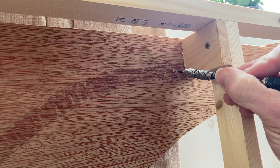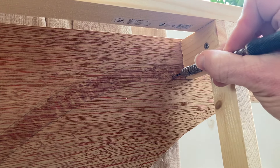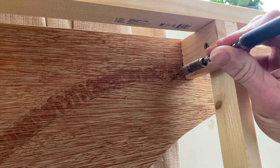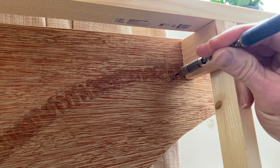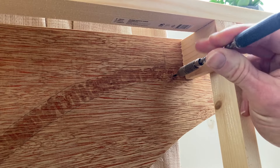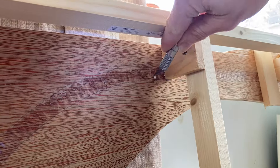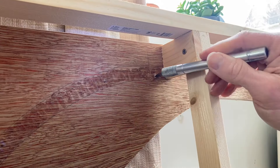This isn't a final solution because it will show that I need to extend the hole beyond these markers to allow a little bit of room for the bar to travel. I now take a knife and cut through around where those holes are to create the full hole, and as can be seen I can now move the point bar and see the hole throughout its full travel.